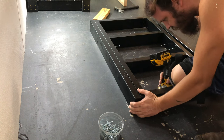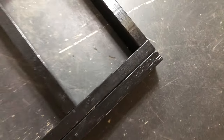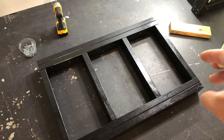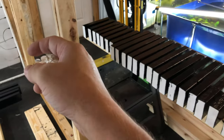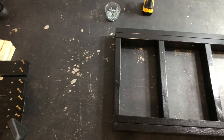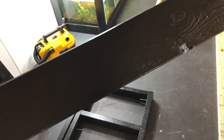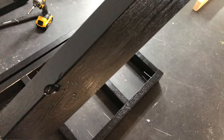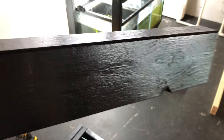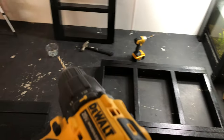That's done. One last touch — throw a 'T' in the top right corner so I know where it's all built from and where the flush top part is, in case it gets flip-flopped, especially when you're doing multiple racks and projects at a time. Easy to get stuff mixed around — better safe than sorry. Now to do two more. I also like to go through and choose the better face for my wood. See how this one's got an indent? Don't put that up anywhere — it could pool water.